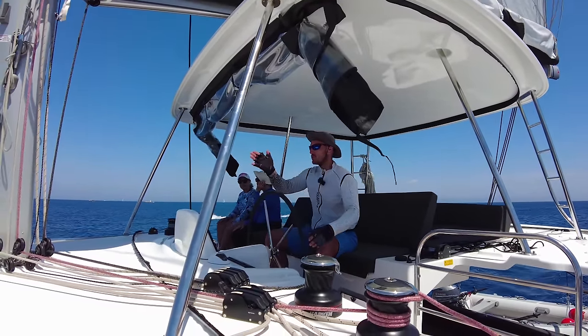Now we're going upwind, so the self-tacking jib is gonna tack. Also the main just tacks alone. But yeah, let's just do it. So I go stand by, take over. And now I'm gonna turn the wheel quickly. You don't wanna do this slowly because you're gonna lose speed and you might not make it, get stuck in the wind, go reverse and get in trouble. Now this self-tacking jib just goes across alone. So it's actually good for self-tacking, but everything else just sucks.